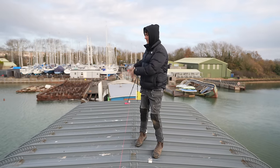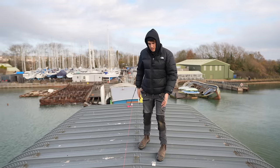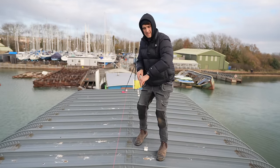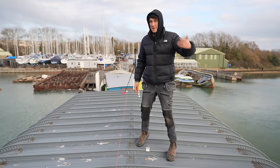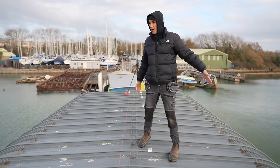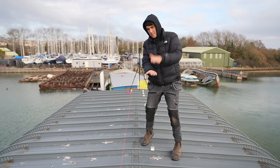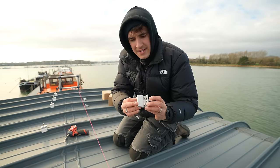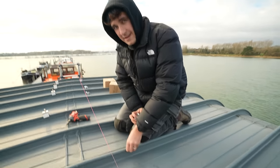Basically yesterday we got a lot of the inside done. So we're making the most of this little weather window to get all of the rails on. We have these clamps which compress around the standing seam, and then the rails sit on top of that. We actually have three rails on this side — the wind uplift is going to be absolutely ridiculous. I did think about doing some solar skirt on there, but I'm worried the wind might even take that away, so we're opting for an extra rail, keeping it tight to the roof. These are the fixings here — this is a special type of fixing which goes onto a standing seam roof.